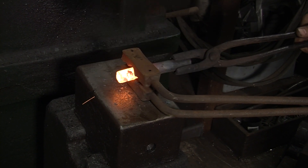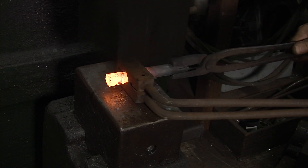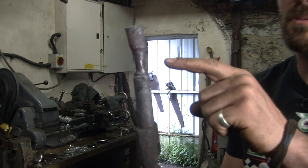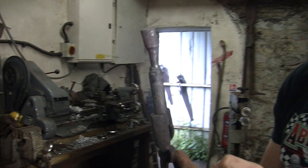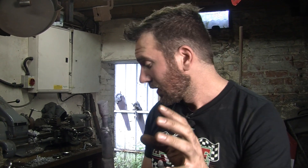I've got a spring tool, top and bottom swage, to reduce the neck on the 20 mil round bar, which creates that. Basically we've separated the material, reduced it in thickness in the middle. This is the handle portion which will be flattened out and reduced further later, but what we've got is a mass of steel on the end which I can produce into the plate that rivets to the pan.